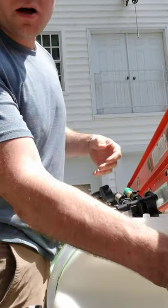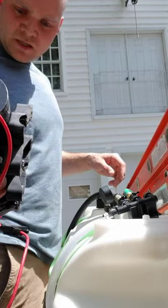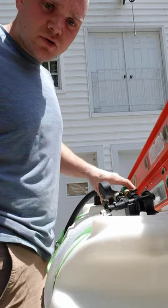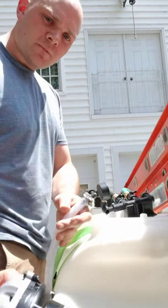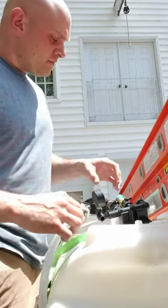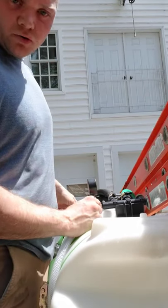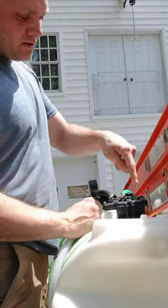The five-and-a-half gallon per minute makes a pretty big difference when you're trying to flow chem up to the peak of the roof or whatnot. I'm going to have to email them to find out why there's water in this brand new pump — but again, they might just test it. The fluid comes in through this side, pumps through, and comes out this side. Then I can choose between whether it flows from one hose out to my hose reel, or I have another hose to easily transfer chem from that tank into this tank.